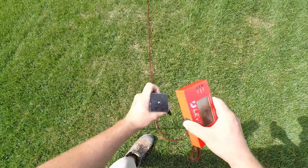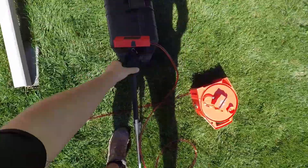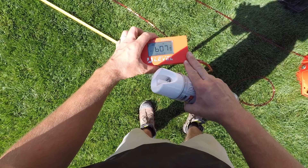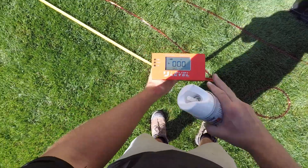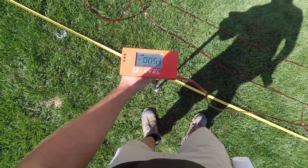Just simply uncoil the hose, turn it on, set a zero point, and then move around and allow it to load a digital readout from that point — whether up or down from that specific zero point. It's much easier than setting up a laser for an estimate or a quote and it doesn't require much training to use one of these.